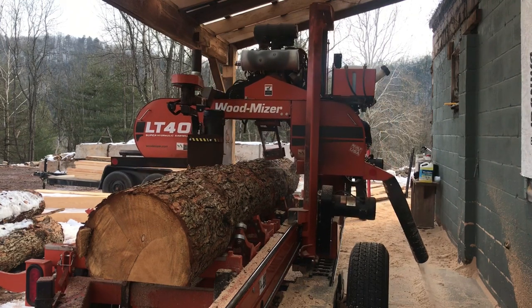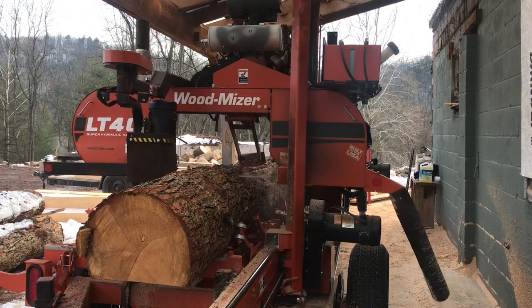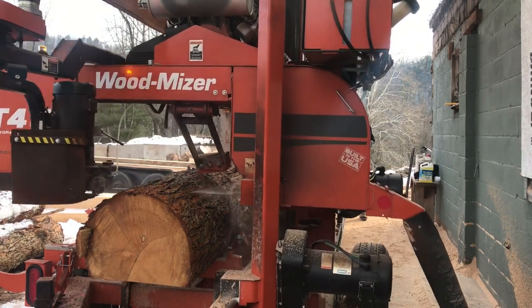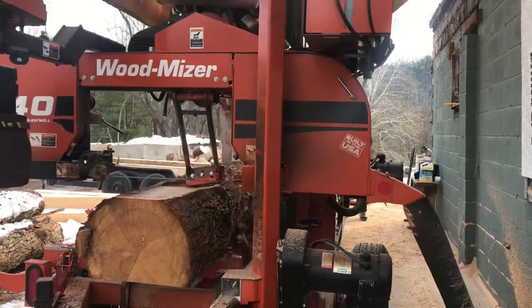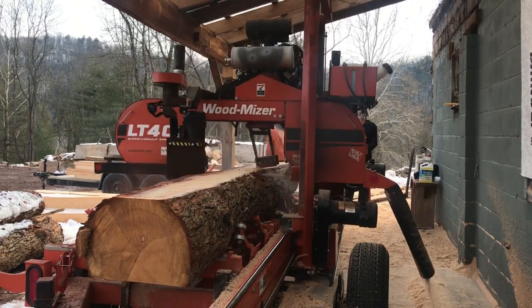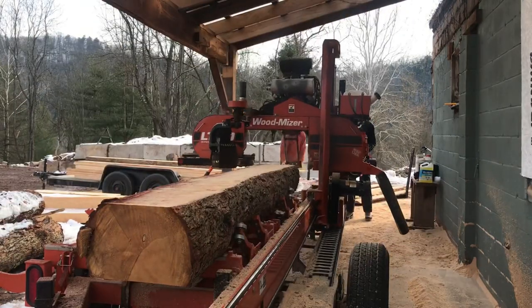Now I push pattern. One of my already programmed in settings is for the mill to cut to 10 inches, so it will drop 1 inch until it hits 10. The jacket boards that I am cutting off right now are going into a jig that will be run through a resaw later on.